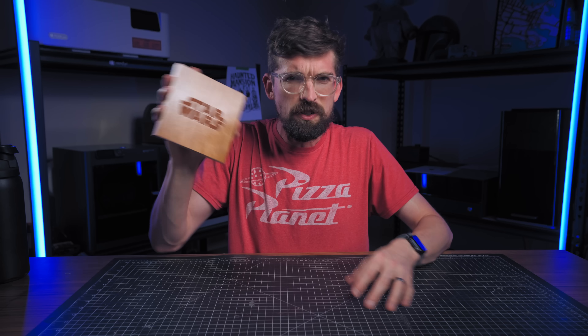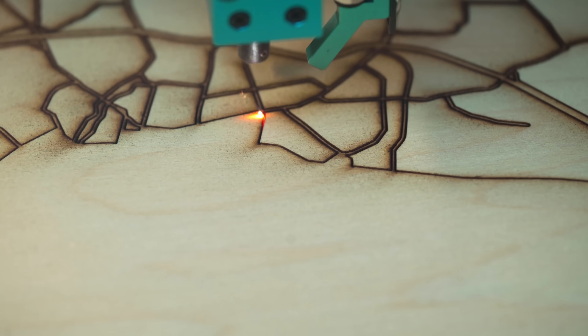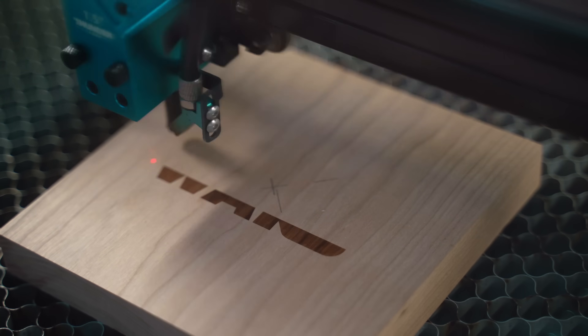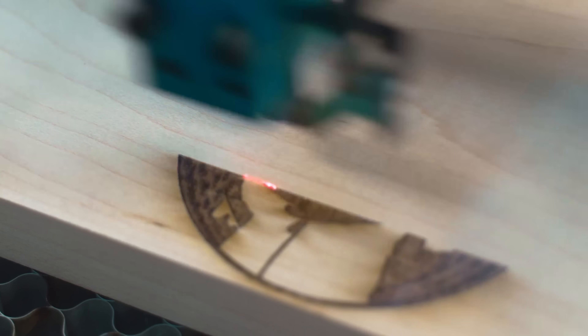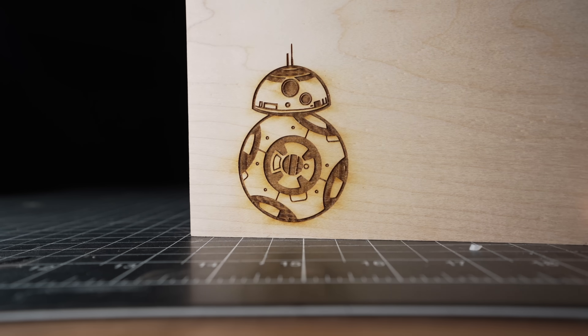While it is simple, you still can make a good bit of mistakes, and the first one has to do with a default setting that your laser might already have on — that is having the air assist turn on while you are engraving. That is definitely a necessity when cutting things out, but when you're engraving it's actually blowing a lot of the soot, dust, and grime into the engrave, especially if you have your power really high. You can see a lot of char marks around the edges.